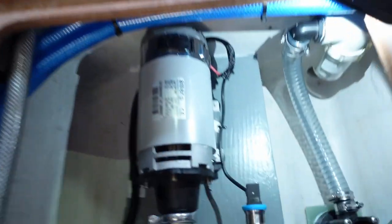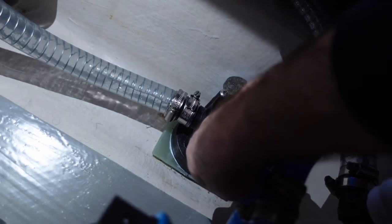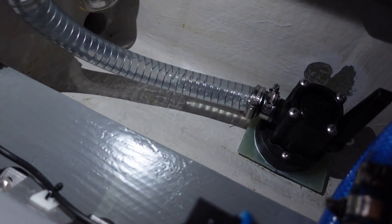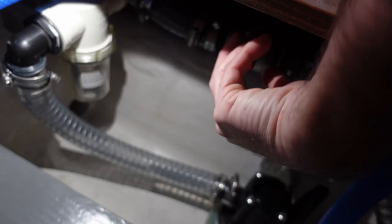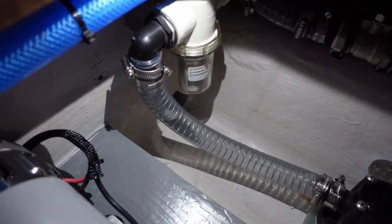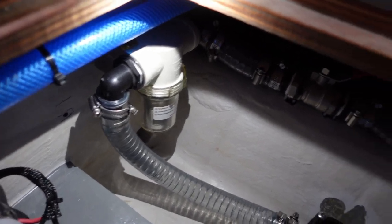First step we've got to do is make sure all the plumbing opens up, no leaks and stuff like that. Let's start down here. First and foremost, through-hole valve opening. Ooh, see a little bit of water coming in. Not a whole lot, because there's a bunch of airlock in the system, that's for sure. We're gonna go ahead and open this stopper valve next. And we're getting a little more water coming up. But no leaks so far.